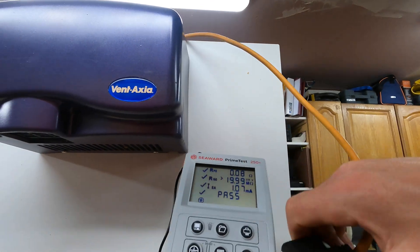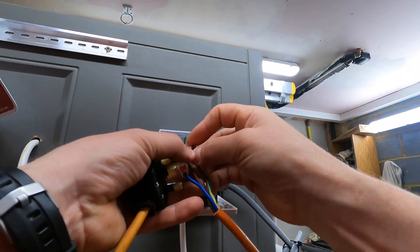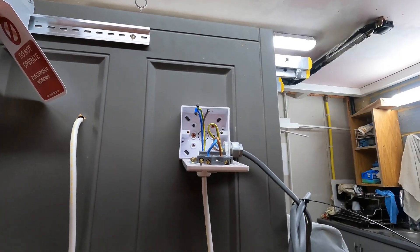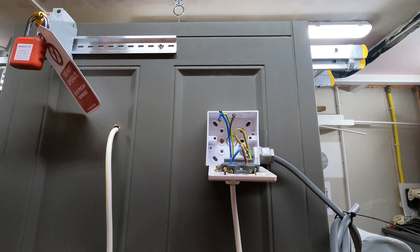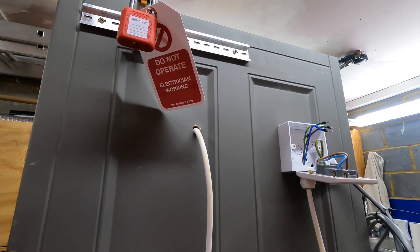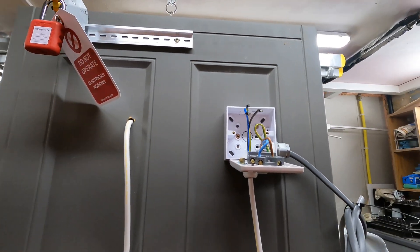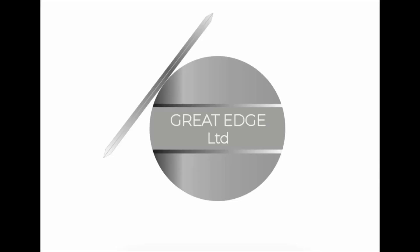Hopefully this helps and is useful to somebody. It's not a very complex device I've assembled — just a plug lead connected with these Wagos — but you can pack it with you, very portable (no pun intended), and it makes it easy to test fixed equipment in a quick and safe way. Just for completeness, I'm going to loop back to the lock-off because it's a very important piece of the puzzle. Please don't underestimate it. Unless you're the only one in the building, don't take the chance that somebody will come along, see the circuit tripped, and flip it back on while you've got your hands in there. Very dangerous. I hope this helps some of you — if you've made it this far, thanks for tuning in. Please hit the thumbs up and subscribe for more content. See you again soon.